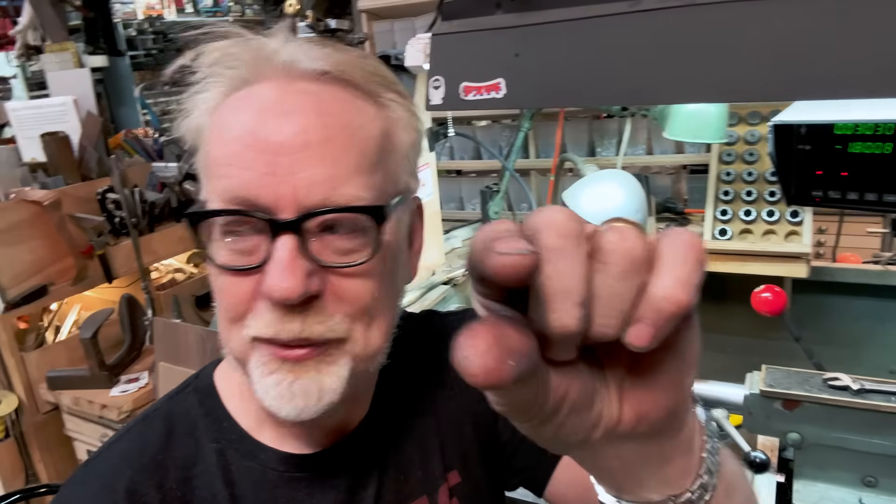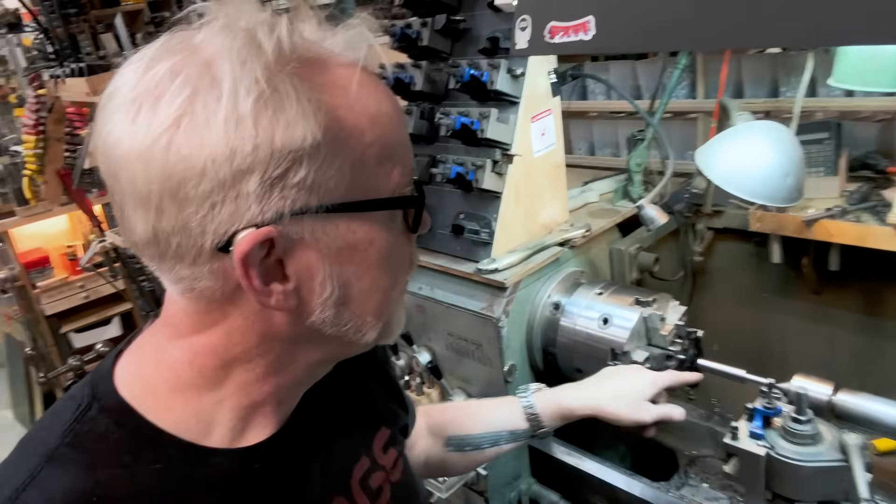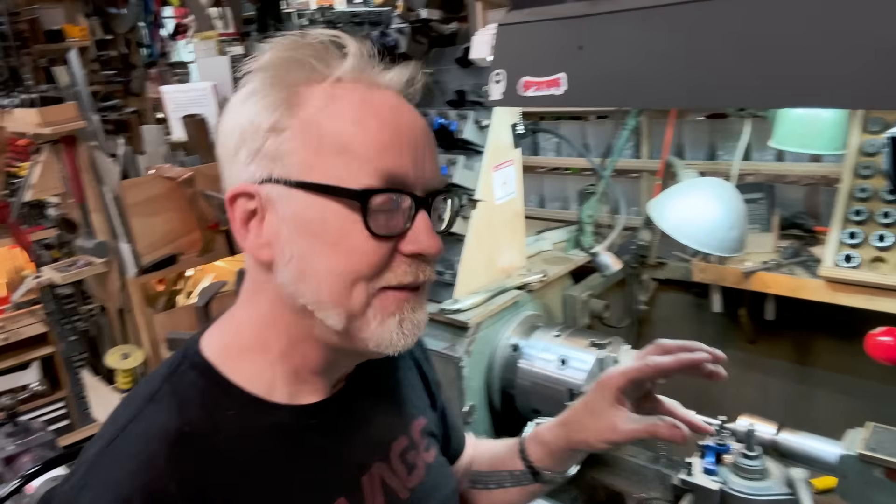There's an issue with drilling on center — I don't just want to take a drill bit and plunge it in there because drill bits tend to wander. I'm going to take a sharp carbide quarter inch end mill, go far down, and then take a drill bit and follow. The drill bit will be held in orientation by the hole, and that will give me my nice clean center — all of this to give me a reliable pin center on my rotary table.